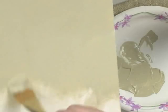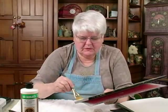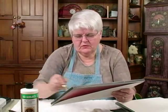You get product spread more evenly than with just a regular one-directional stroke. So again: slip slap, smooth, and on wood go with the direction of the grain. With at least 10 to 15 percent or more all-purpose sealer, you've made a background paint and don't have to do anything else. Note that the more all-purpose sealer you add, the shinier the background color will become, so I prefer to keep it around 10 percent for a more matte finish.